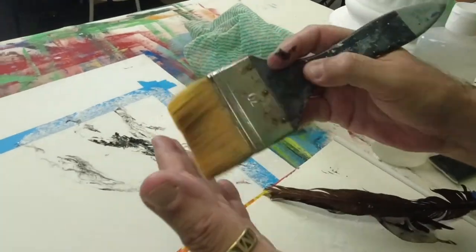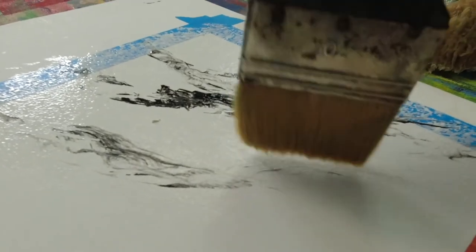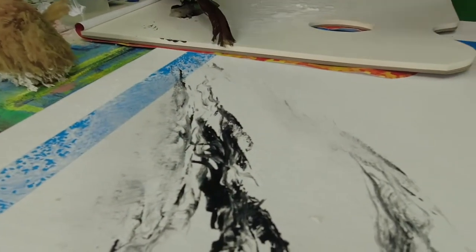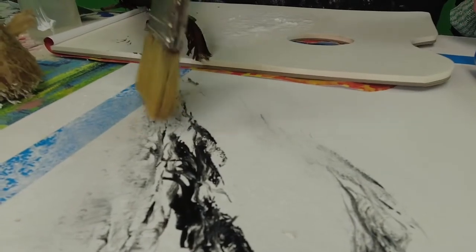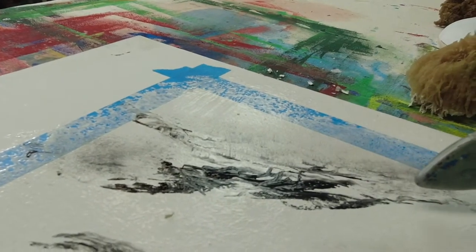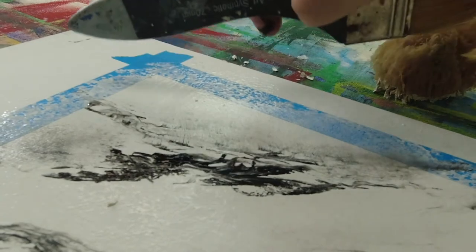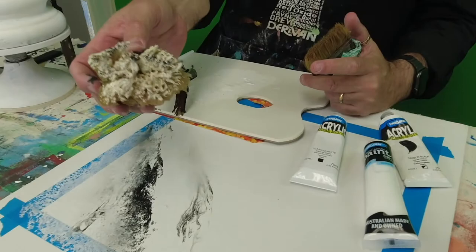Just remember you're putting it over that wet background, and now I'm softening it. The idea is to use a dry, soft brush to blend that black into the mottled white background, and you can do this either by stippling or brushing. One thing to remember with the veins is that you tend to have sharp lines on one side of a vein in marble, and the other side being a little bit feathered.